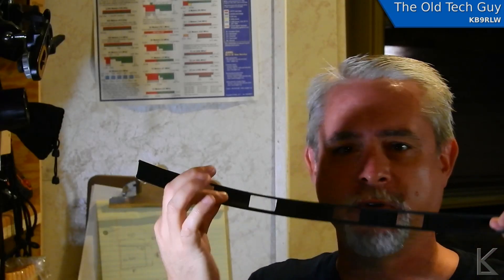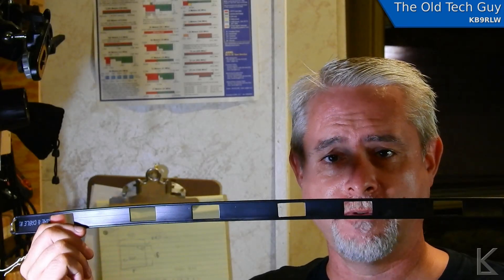I'd have to figure out what's a third of the way in from each band edge — that would probably be a good center point to cut each leg. And then you'd have a single piece of material with one anchor point at the end. It'd be easy to roll up to put back in your backpack or whatever, and relatively easy to put up. So that's the plan: I'm going to make a fan dipole for 75/80 meters using window line for the element.